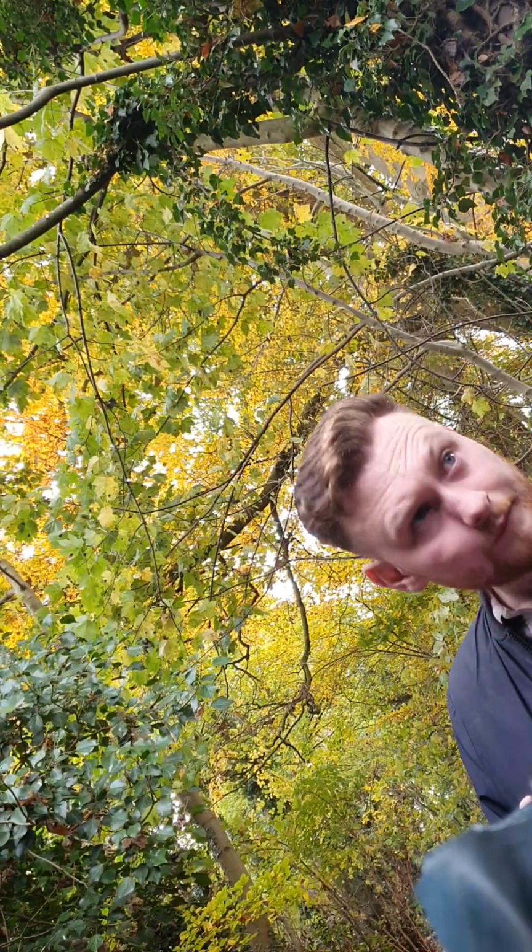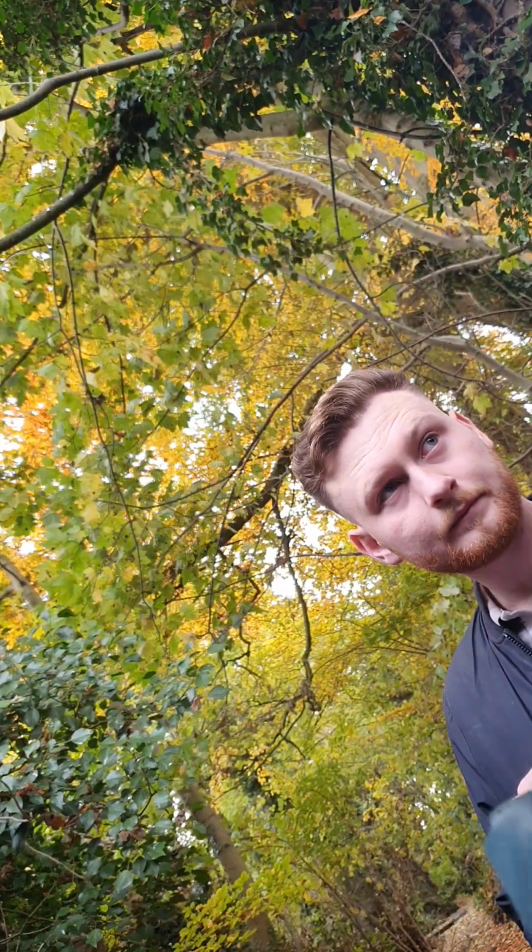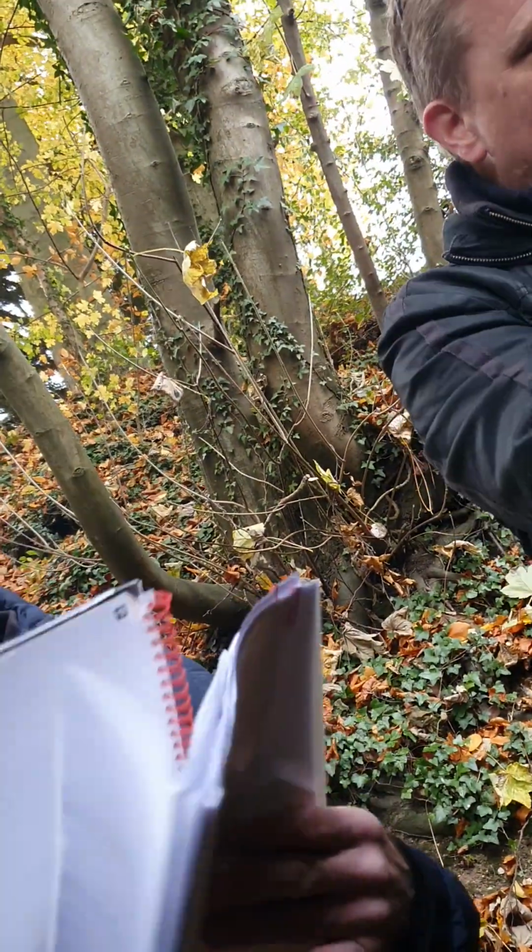So actually, you're probably a metre down by the time you get back to the bed level. But you may find as you go down, I mean, that's based on the site investigation, but it might be worse, it might be better. Basically, what you're trying to do is spread that load from the walls back along the base. So that base is the foundation, really.